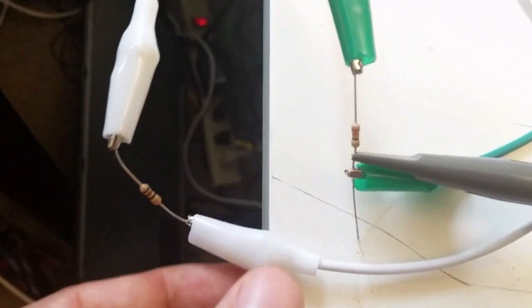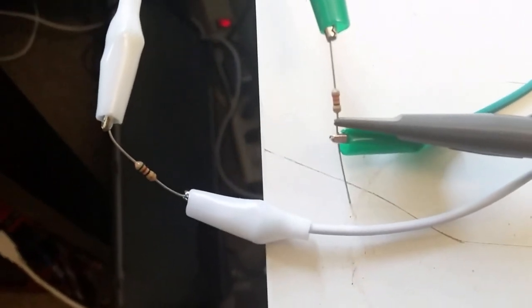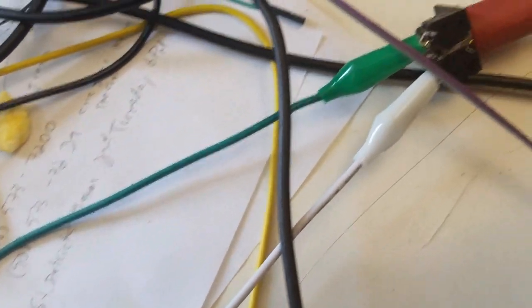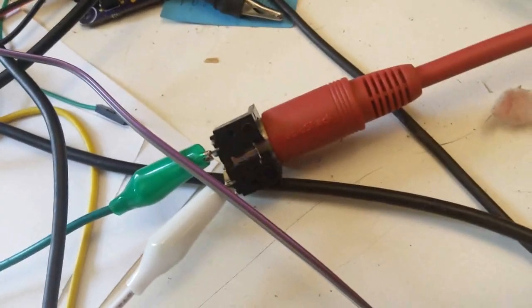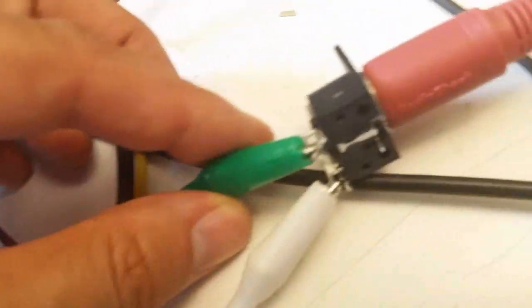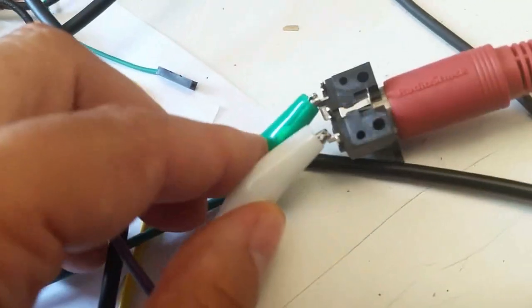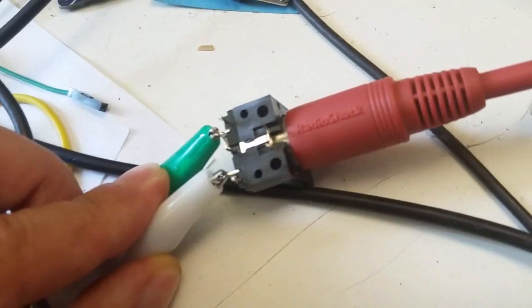Anyway, so I've got these 2 wires going along here. I'm gonna follow them along. Now it turns into alligator clips. And here I've got 2 resistors. Because MIDI is really concerned about current, you have to have just the right amount of resistance in there. So normally that would be in a circuit board, but I just kind of threw this together after seeing Planet Booty last night. I thought it'd be a really fun way to demo the board. Now here we've got your DIN 5 socket, and I've connected the alligator clips up to pin 4 and pin 5. And now I've just got a good old Radio Shack MIDI cable, and that's going up into the MPC.